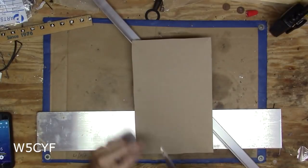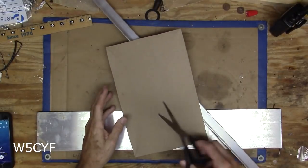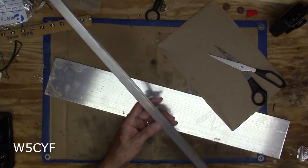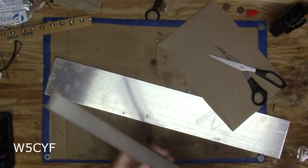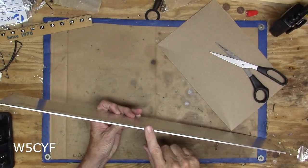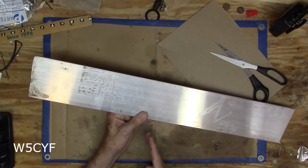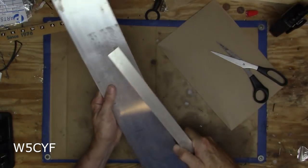As I said, we're going to be using my old school CAD program — nothing more than a cereal box and a pair of scissors. The material I'm going to use is just material I picked up at the local metal supplier. This is eighth-inch thick, one-inch angle iron, and you're going to need four feet of this. The back plate is one-eighth inch — 125 thousandths — by four inches, and this piece is two feet long. So I'm going to cut it in half: two one-foot pieces. The angle iron will become the side braces. Again, I'm just making a hinge here.